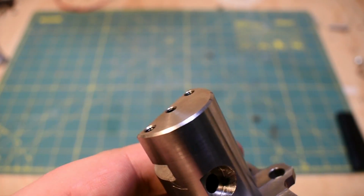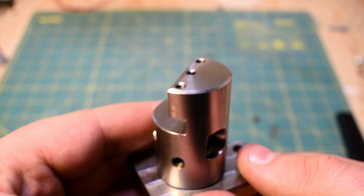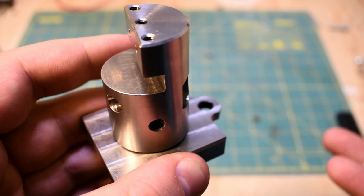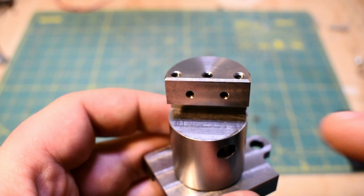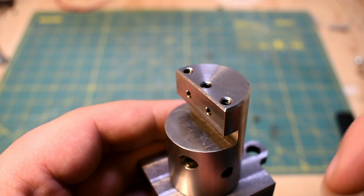The lathe is a very old machine tool, so naturally tool posts are very well developed. One thing you'll often see is being attached from the center, and it'll be held down onto some kind of spline or a taper, or just held rigidly in place against a flat surface. I didn't want to do that because I wanted my tool to be on center line, because then I can sort of predict my radii a little better.